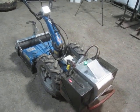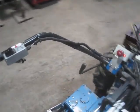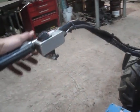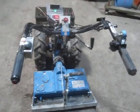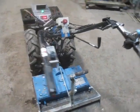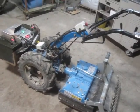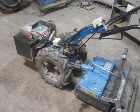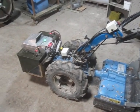We wanted to render the machine a little bit safer. Anyone who's used a BCS indoors knows the frustration of reaching for the clutch lever, which used to live right here — it's now been deleted. Trying to reach the clutch lever as the machine pins you against the wall in reverse is very irritating. Plus it was kind of a fun technical challenge, and now that good batteries are available there is no longer a big obstacle to this.